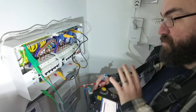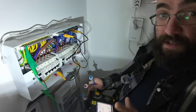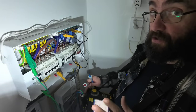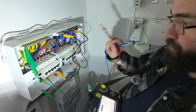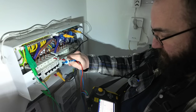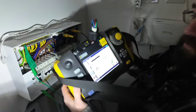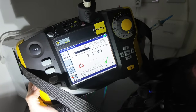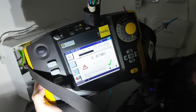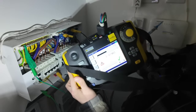There can be issues — let me switch some in to show what happens when a load is connected. I've gone into the kitchen and turned on every single appliance spur, so all those integrated appliances are now on — it should affect our reading. Carrying out the test again on the kitchen circuit: before we were getting 300-odd megohms, and now we're getting 3.87 megohms. The appliances are dragging the reading down. That's still technically a pass, but you can see it's quite a significant difference.